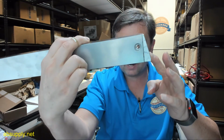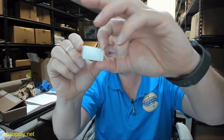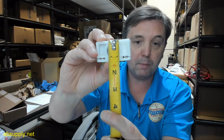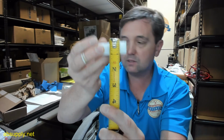You'll attach it from the bottom, and by the way, screws are included on everything. Before you attach it, you'll insert the slide block into the assembly, and the slide block is certainly included. This little feature to it will go towards the exterior face of the door. Let's review the slide block dimensions. Overall length about 2 1/4, with a depth at about 1 1/4 inches, at a thickness at about 11/16. Locate the mounting holes, attach the brackets to the face of the door, insert the slide block, snap the track end blocks as shown, secure in place with the 5/16 screws.